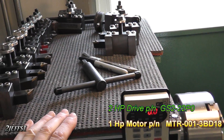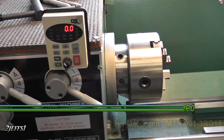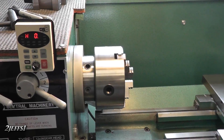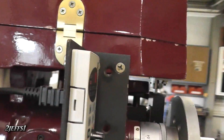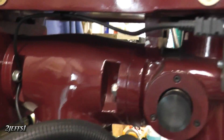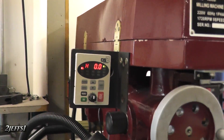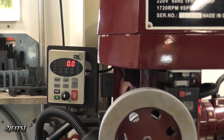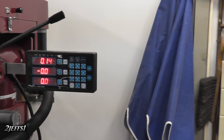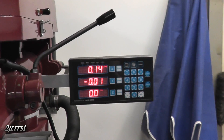For this lathe I got a 220V two-horsepower drive and a one-horsepower motor running the machine — works fine for what I do. Over here for the mill I have another display panel and cord that comes off around to the back where I have the drive inside that housing. It's the same setup: one-horsepower motor with a two-horsepower drive. I like oversizing the components, and I've read that's also a recommended practice.